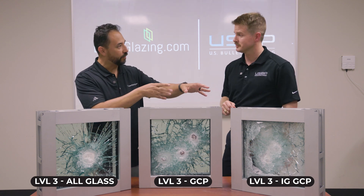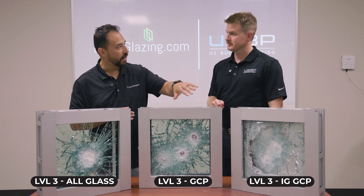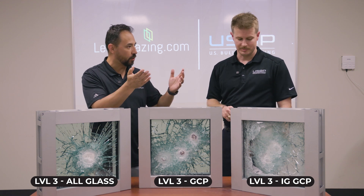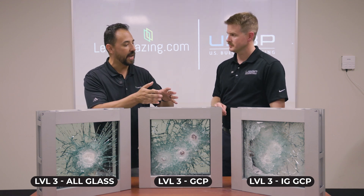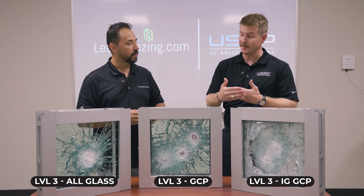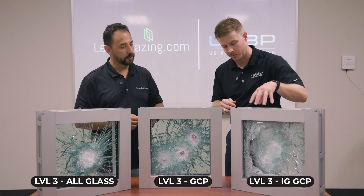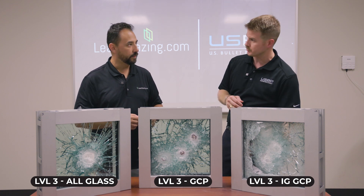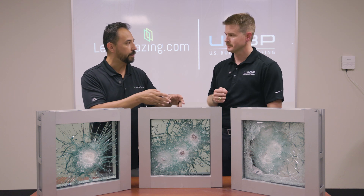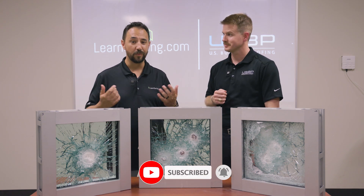I have to talk about this one because it looks scary from the outside — you have that single quarter-inch piece on the front, and then the space, because it was an IG unit. So the first piece obviously collapsed because it's just a quarter inch, but all the protection is happening after that airspace — the main protection comes from the inner laminates. It will break that outboard quarter-inch light, and that is completely expected. That's why you're using a tempered piece of glass, in case there's any glass falling or anything like that. Very cool, let's keep going.